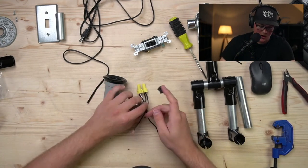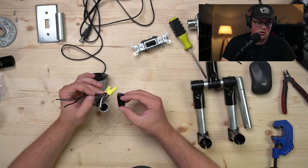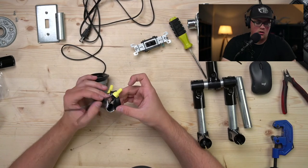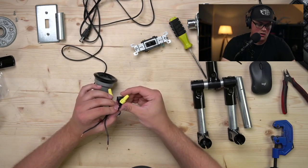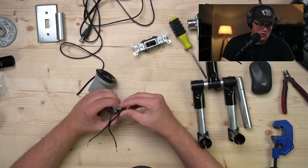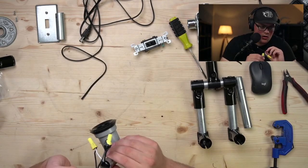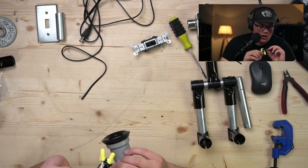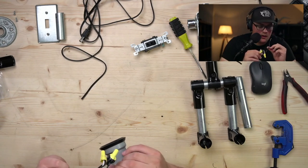He said, be sure to watch the hot leg. The hot wire, I'm reading Bob Clare's comment. The hot wire on the cord will not have a rib surface. The common neutral will have a rib surface. Okay, thanks, Bob Clare. And then the white is the hot on the lamp, correct? And the black is the common? Yeah. I think both of these are ribbed.